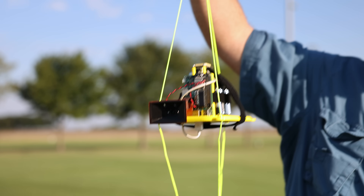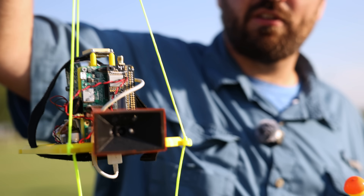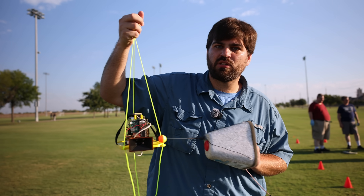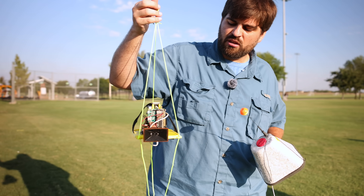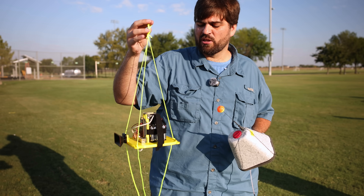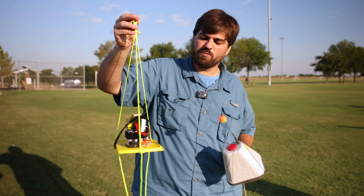This is a camera payload. On the front you can see a Pi camera — that's just a standard Pi Cam V3 wide, connected to the Raspberry Pi. We did have to shield the cable going to the Pi camera, because the CSI interface actually causes noise. It caused the GPS to come unlocked, so we shielded that and it actually helps a lot.